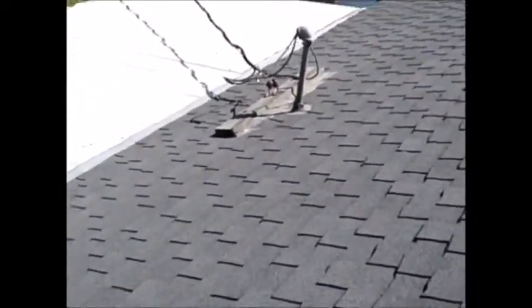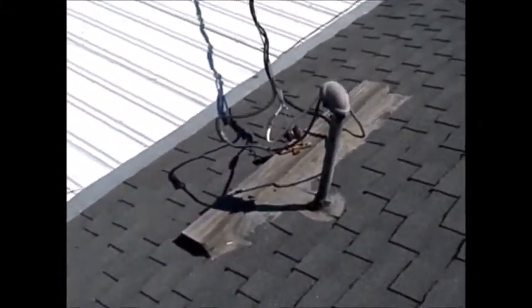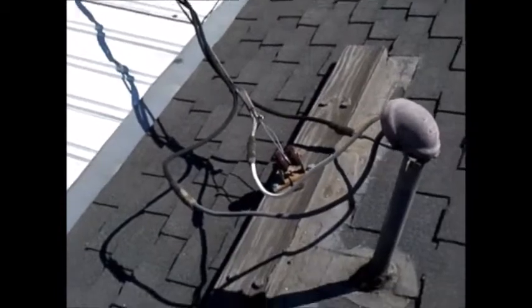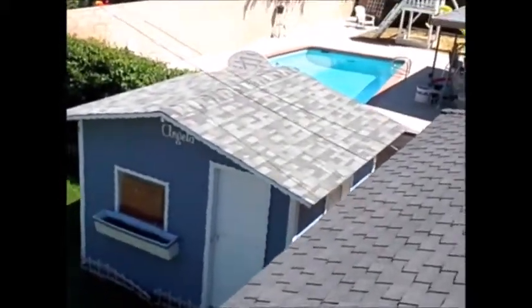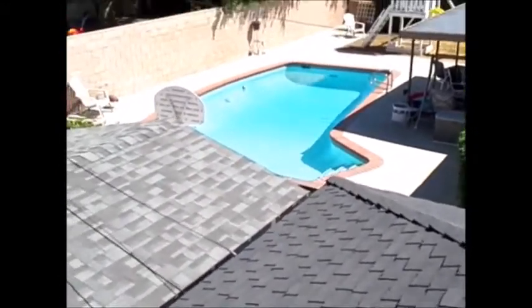And these are your service cables coming in from the hole there. And the service cable is low. And when they put the new panel in, they'll have a higher mast head. And that service cable will be raised a couple of feet. So that will be taken care of. There's a little storage room or kids room in the back of the house. We don't test or evaluate. Neighbor has a nice pool you may want to meet.